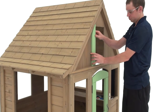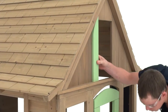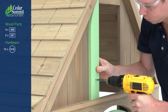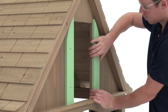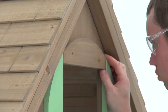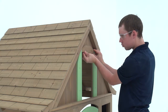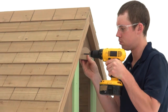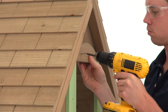Place a shutter side along one side of the opening at the top of the door wall. Make sure the long edge is flush to the edge of gable B and the bottom is tight to the soffit front back. Attach it with two wood screws. Install a second shutter side at the other side of the opening. Now add the shutter top just above the opening — when the bottom edge is flush with the bottom of gable A, the rounded top edge should form an arc with the top edges of the shutter sides. Attach the shutter top with two wood screws. Repeat all steps to install shutter sides and a shutter top around the opening of the back wall.